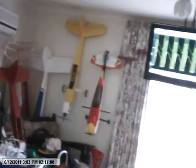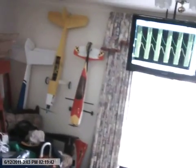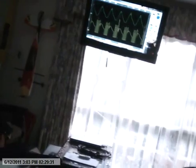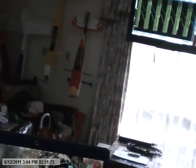While you're watching this, I will actually take screenshots of that and present that too on the forum. So if you're just watching that, I'll short out the supply. You can see the waveform drop. And if you can hear the motor in the background, you can hear it accelerating. I'll disconnect. I'll stop talking. You can hear the motor decelerate. It picks up about 200 to 300 RPM when we short out the supply.